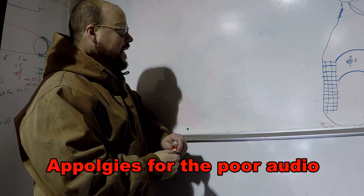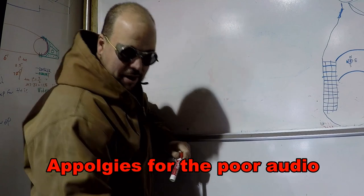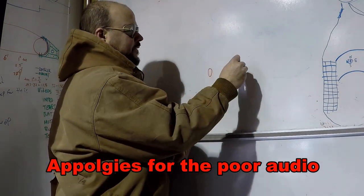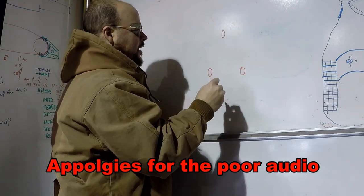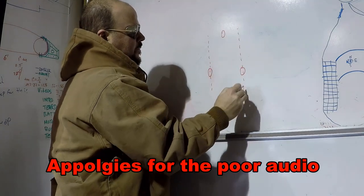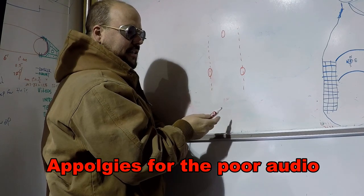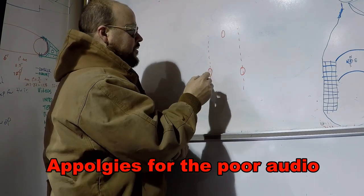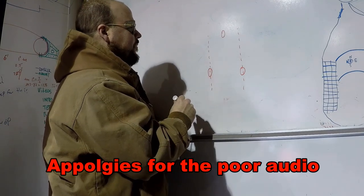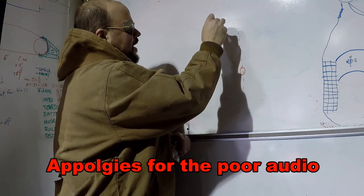All right, so the last thing I need to do before the airframe is all complete is drill the holes to set the toe in for the main gear. What toe in is, I've got tricycle gear, and the toe in is the angle between the center line of these wheels. They recommend doing all this after the wheels are installed. I think I actually would do it with the square and the axles, but I already got it installed. But anyway, I want to get these toed in.